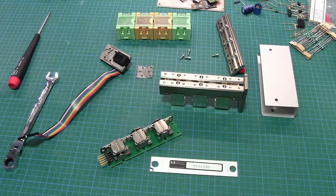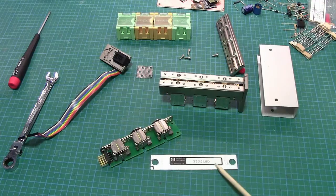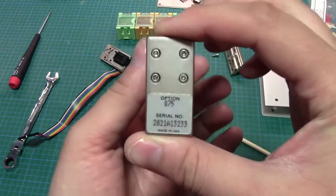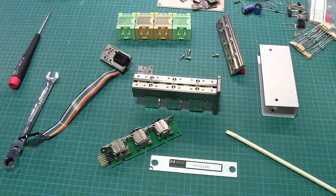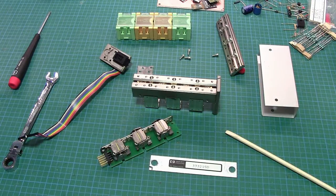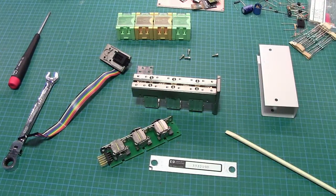And in fact, in the data sheet for these model numbers, it should have been obvious, in hindsight, of course, that with the same 33321 model, there's actually several variants of it. And it wasn't very well indicated what the variants or the variant combinations were and how you identified them. But it looks like, again in hindsight, the option 75 here actually probably means that it's a 75 dB. And the combinations for, say, 75, 70, 75, and I think 140 was the other one, they're very specific. They'll have certain pads to come up with that full 75 dB attenuation or whatnot. So that's that. Case closed.